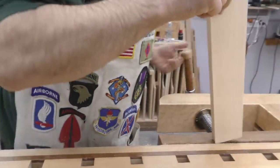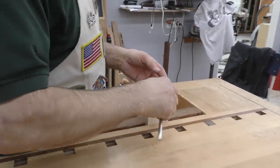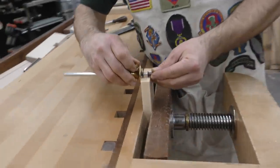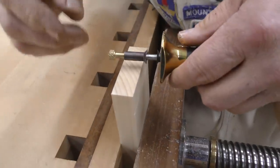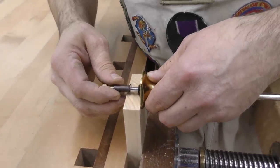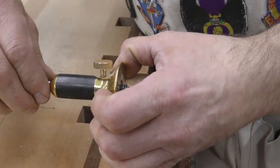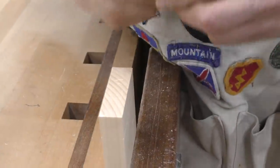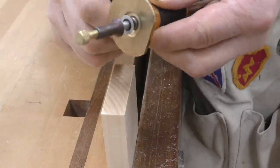Now I am going to put this in the vise. Next thing I want to do is center the tenon in the middle of the board, so I am going to guess at it first. Lock the gauge, and then simply push that down, then turn it over, and from the other side I will see if I am close. I am not quite, so I have to move that a little bit more — bring that over just a bit, lock it again, push it down, turn it over, and they pretty much line up. So make sure that is nice and tight.